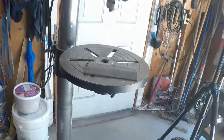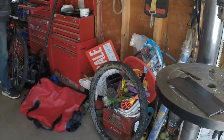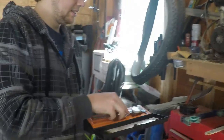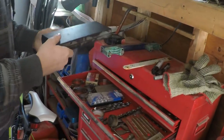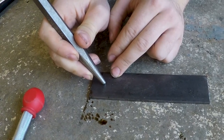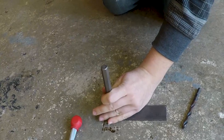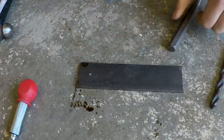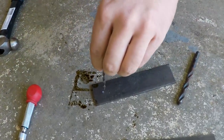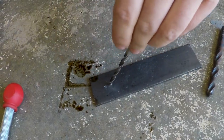It'll allow a tiny bit of clearance. Do you want to put a pilot hole in this? Yeah, we can't jump right into that — it'll struggle. We got the little prick punch mark there, so set that up. Now the drill bit definitely won't wander; when it goes in it'll sit inside that mark and won't drift around as it tries to grab hold.